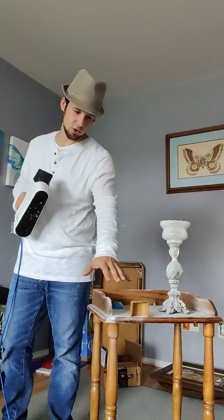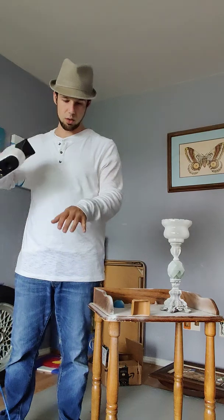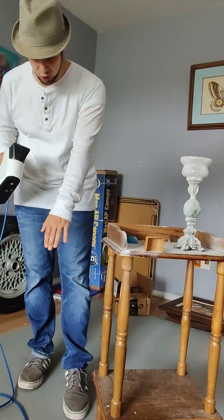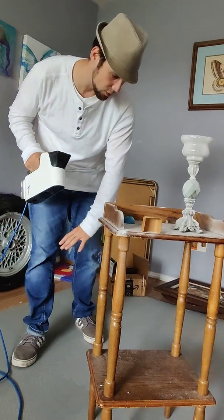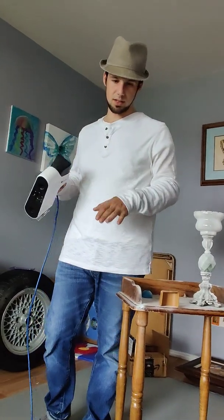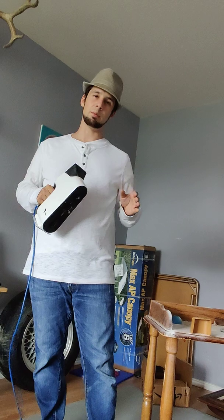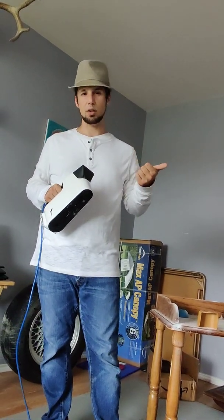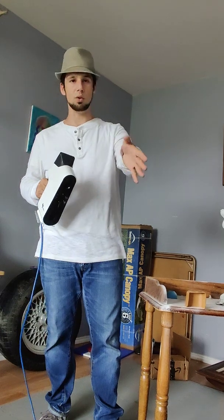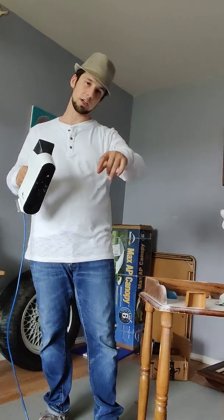Another big tip is you want to have a good surface that you're putting the objects you're scanning on. So this whole environment I've kind of been playing with, with the matte little puzzle pieces, if you look at the floor, would this be a good pattern? I found this really good as far as the matte color, but the uniform pattern of it, it actually kind of gets lost in that uniform pattern and it doesn't know exactly where it is sometimes. So I did see some difficulty with that. It seems like what this likes a lot is unique straight lines and a very matte surface. So surprisingly, a rectangular cardboard box is a great example of something that you can scan on top of. It will be able to pick up those straight lines, those angles, and whatever you have on top of it, it's able to read, hey, there's a floor there, there's a wall there, and then the piece is on top of it, but it's constantly picking up that cardboard box around it.